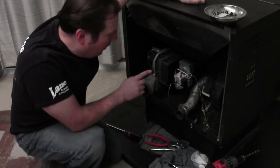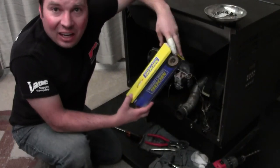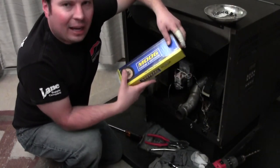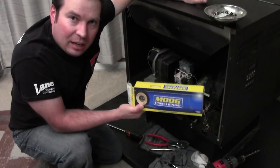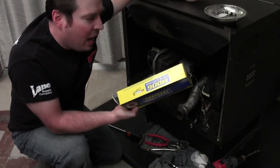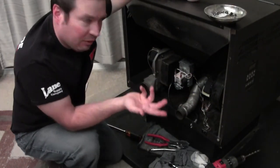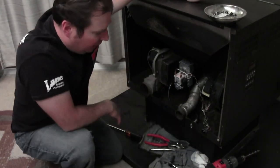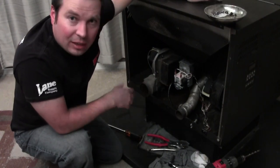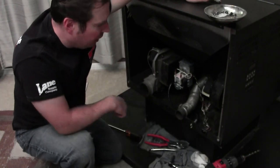As I mentioned in the video, here's some information on this hose kit. It's not a kit made for pellet stoves — it's actually a grease kit sold by Moog, which I got on Amazon for about 12 dollars. It's designed to make greasing the idler arm on some steering components on a vehicle much easier, acting as a remote grease access point. I found it through a Google image search and realized it was exactly what I needed — cheaper than buying grease zerks, a 90-degree fitting, and hose separately. I'll put a link or part number in the description so you can find it yourself.